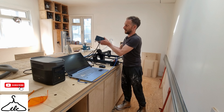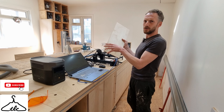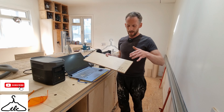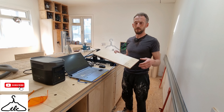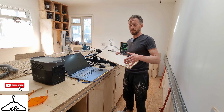I want to see how this machine handles six mil birch. I've done a few test cuts and I thought, being really powerful, I'd be able to churn through thick material in one pass — but that doesn't seem to be the case. I tried 12 mil birch and found it charring a bit, maybe because I was going too slow. I started at around 100 mils per minute, which is pretty slow for a laser at full power, and that was too slow, so I went up to 200.